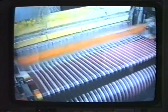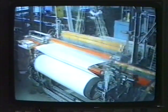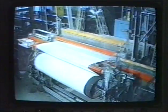This particular loom is weaving organzine silk for theatrical costumes. Here you can see, to a new design, small diamonds being woven. We can, on certain looms, use two shuttles. The double shuttles are used for producing specific patterns or weaves in the silk. Here, for example, crepe silk is being woven.